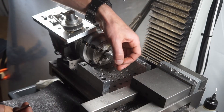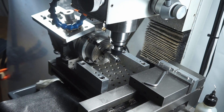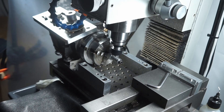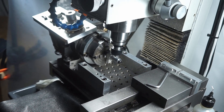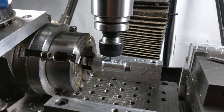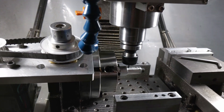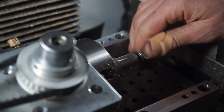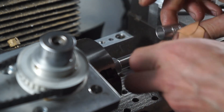The last little thing to round off my week was some actual machining - a little job that came in for a company called Goodwood Golf. He makes custom putters, some really nice ones, so if you're into golf go check him out. These are just little bands that go on the putter shafts as accent pieces. These ones were cut from aluminum, and they look like a very simple part, but on the inside there's a slight taper which made the work holding a little bit different. The little band slides onto a machine taper I made, and a socket head cap screw pinches an aluminum washer and squishes the whole thing together so it repeats quite well.